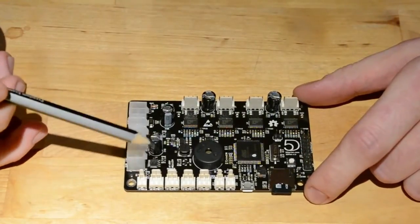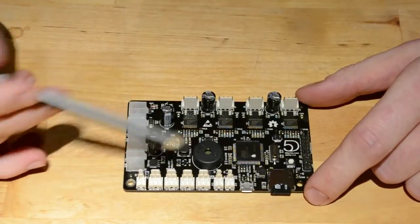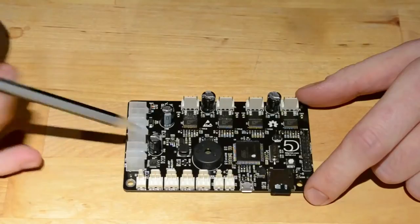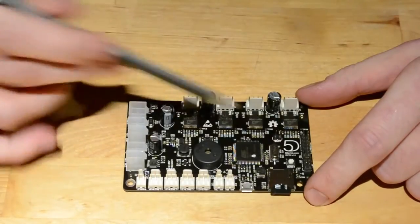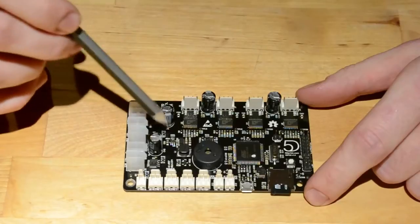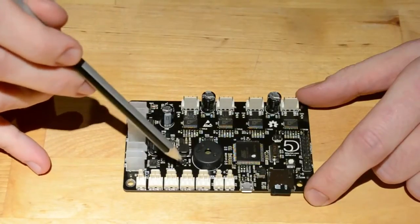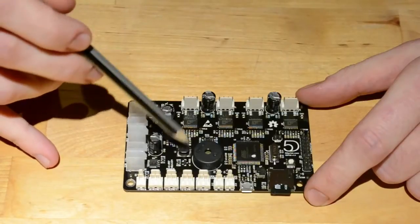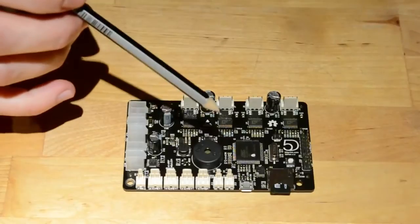Other than that, it's mainly layout tweaks. A few things have been shifted around — the 5-volt regulator has been moved from over here up to here, closer to the input stage, just to keep all the switching high-current stuff away from the microcontroller and the sensitive bits.